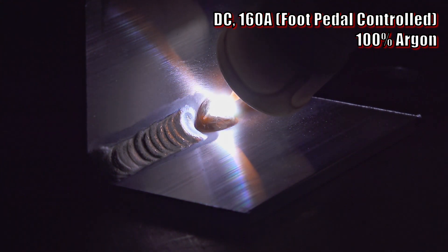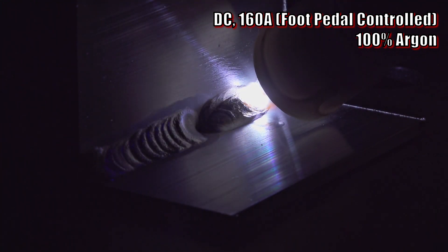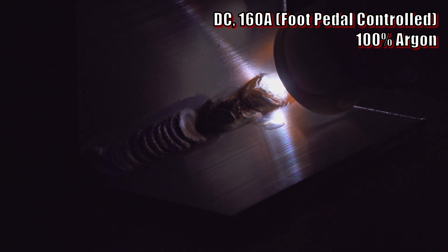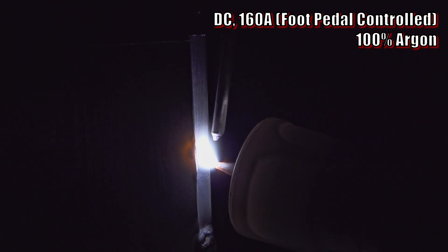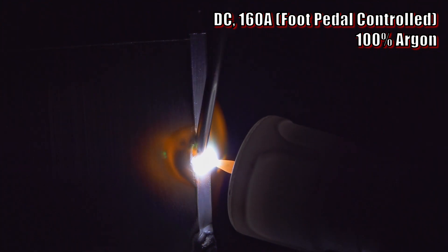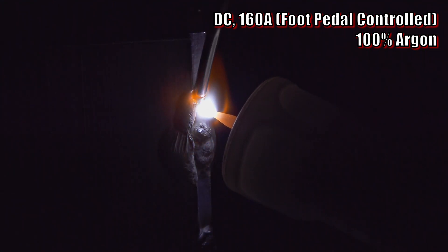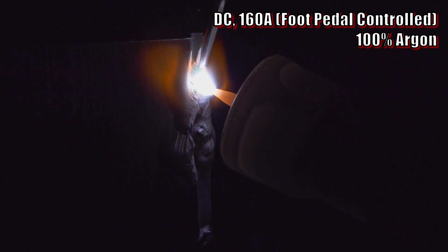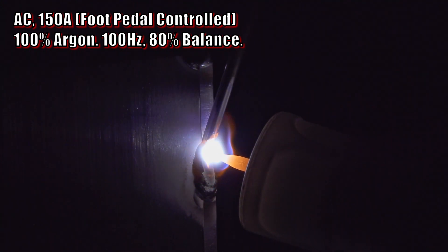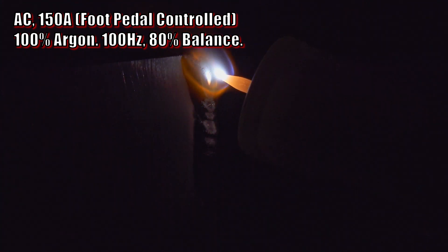And if you're running in any position other than flat it's a fight to keep the lumpy, skin-covered weld pool where you want it. It's also sometimes tough just to get two pieces to join in the first place because you get the two molten areas resting up against each other but they have that skin of oxides around them so they don't want to actually melt together. This makes it especially tough to correct any issue once it starts — sometimes you get a pit or a low spot and you just can't fix it because the skin of the oxides won't let it flow back together. And even best case scenario, you aren't going to be making good looking welds. Even once you brush off the burnt crust, you're going to be left with a lumpy, wrinkled mess of a weld. You certainly aren't going to be stacking dimes with DC and argon.